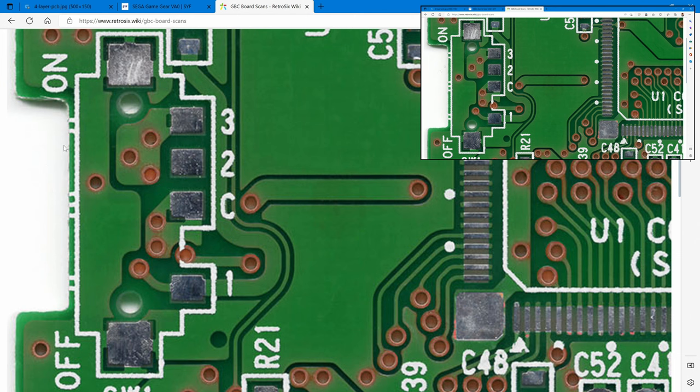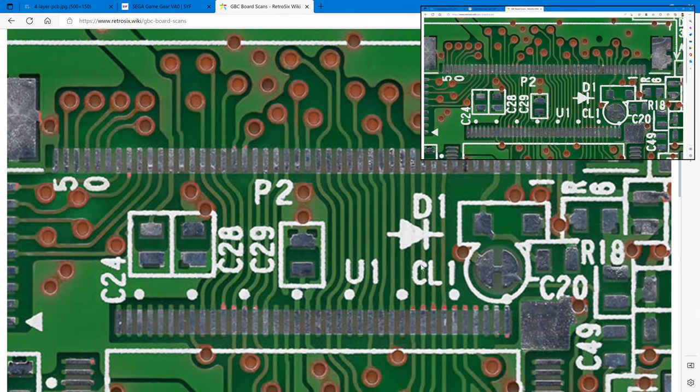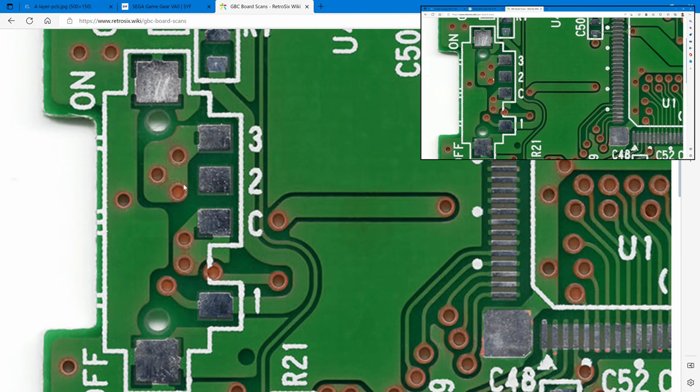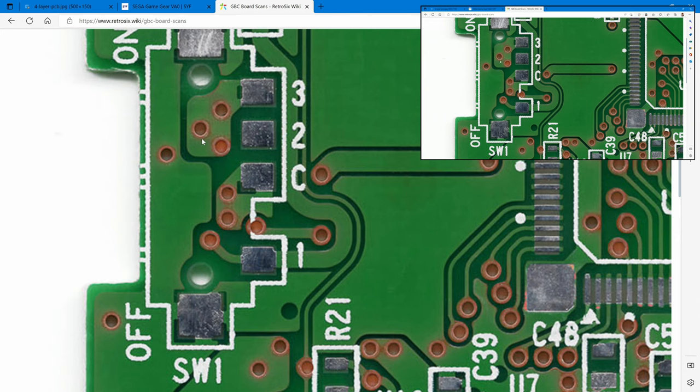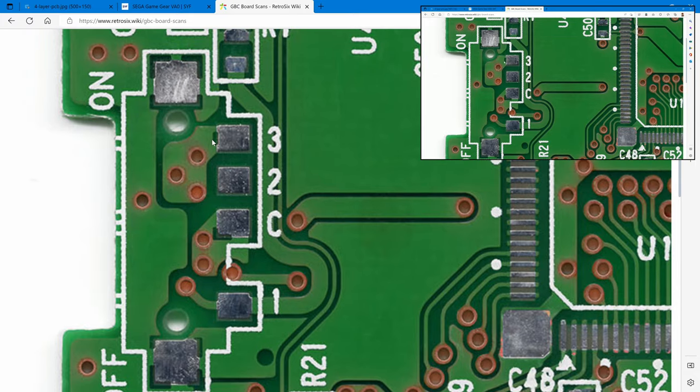To identify where those pads go, you need to understand what you're looking at on a circuit board. Most circuit boards have white ink — this is called the silk screen, because that's how they get the emulsion ink onto the board using a silk screen technique. That's the very top layer. The next layer down is an electrical insulation layer, typically green. Below that is a copper layer, which you can see coming through holes or exposed as solder. Below that is the dark green prepreg, which is the dielectric between the top and bottom copper layers.